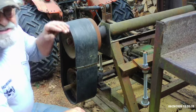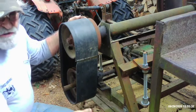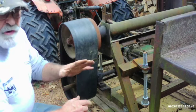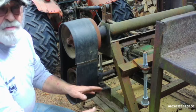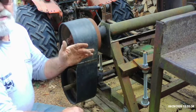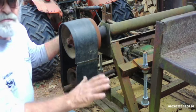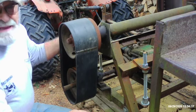So if you run a flat belt that's 15, 20 foot long or longer, you have to be very careful when you're walking past that, because that belt will create an issue for you. A lot of times guys will use belt dressing on that flat belt because it's so hard to get your belt tension just exactly right to minimize slippage, because you have to drive those stationary rigs into the ground with bars. A lot of times they won't get them driven in quite good enough, and you put a little tension on with the tractor backing up. The tractor weighs 2,800, 3,000, 3,500 pounds, and it wants to shift your rig just a little bit, and your belt runs off. So a lot of times they run them a little bit looser than what's recommended, and that looseness, that flippy flop, is very notorious for grabbing shirt tails and baggy bibs and things like that.